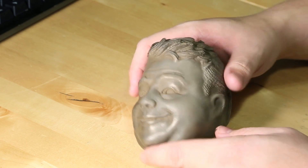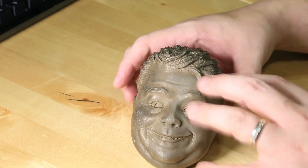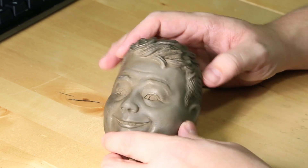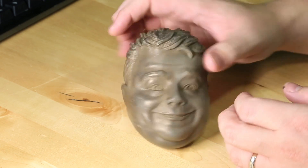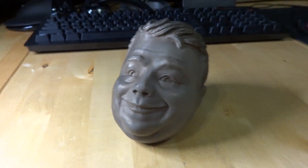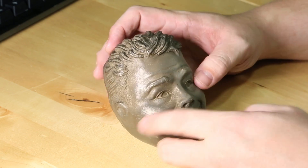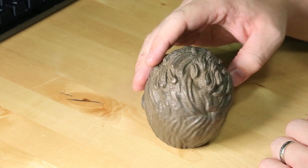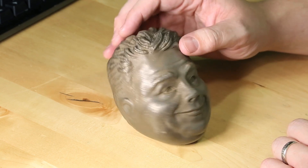After polishing for about 10 minutes you can see this side is more of a bronze color. It's not as reflective, and I think that has a lot to do with the cloth I used not being soft enough. But you can definitely see there's more bronze color now and it is still reflective. With that metal applied to the surface from the polisher it's like a freaking mirror. If you want it to shine perfectly, you can hand wet sand it, or use polishing pads and buffers with polishing compound — you can actually get it to look just like a penny. Honestly, I kind of like the stainless steel pin residue look. The rock tumbler is definitely the way to go if you're printing in metallic filaments like ColorFab BronzeFill.